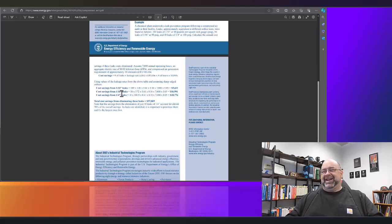So we'll take that 1/16 inch leak. That's 50 leaks times 5.72, which is the CFM calculation, times 0.61 times 0.18 times 7,000 hours times 0.05, which is 10,991. Now it's really easy to say, okay, if this is 10 cents, then that doubles to basically 22,000. So in any case, you can do that across all of this in order to get an idea of what's going on in the plant overall.